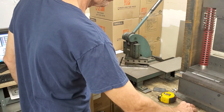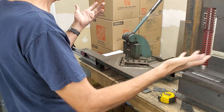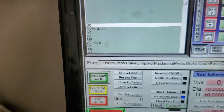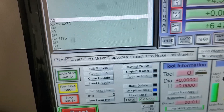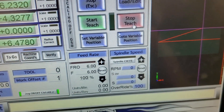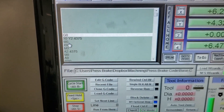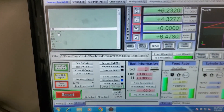Getting Mach 3 to make stuff on a press brake and notcher is actually relatively simple. I just wrote some simple G-code. I tried to write the G-code in Notepad but it wasn't working right, so I ended up going to teach MDI. There's a teaching function and I basically just taught it — put the steps in, created the file, then went through and modified it. I put some M0s in to stop it in between each step. Really pretty simple — a lot simpler than I thought it was going to be.